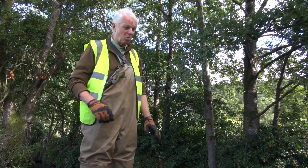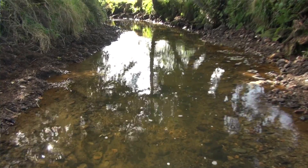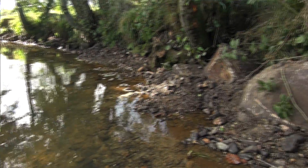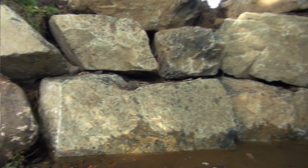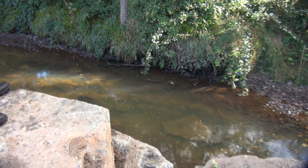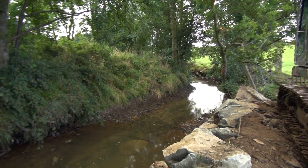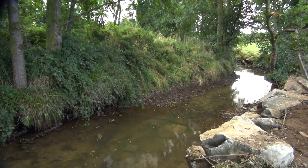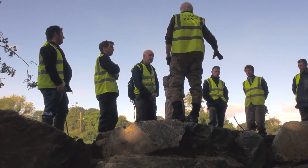We've selected this site to create a little bit of a pool, not least of all because the bed has already been disturbed here and we've got all this rock armouring that's been put in to shore up the bank for the farmer, and a drain has been put in here which discharges about that much above the water level. The other reason for selecting the site is there's obviously suitable material here — there's some big stones dotted around the bank and we can use those to create a single cheek, or a flam or a berm, at the head of the pool to get enough acceleration into the pool to keep it sediment free.